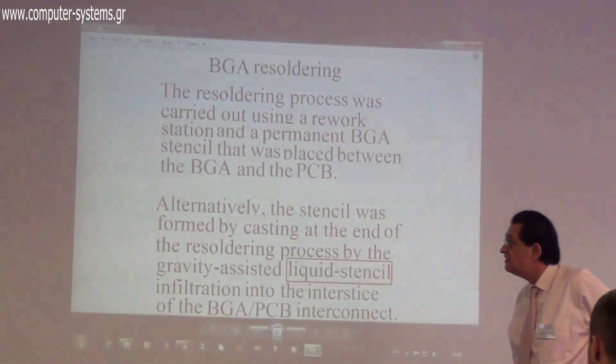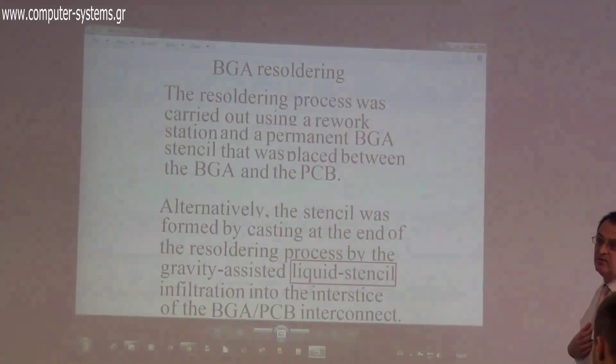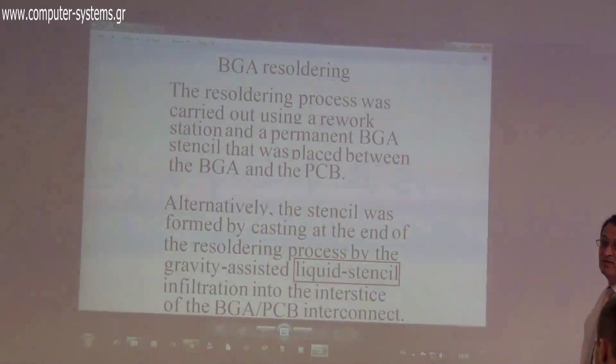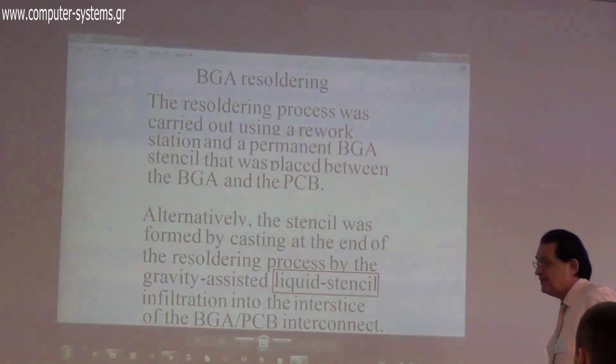We mix the binder, the ground rubber, and the protective filler to produce the membrane. You can also fit the liquid material directly into the gap without pre-forming the membrane — this is what is called casting.